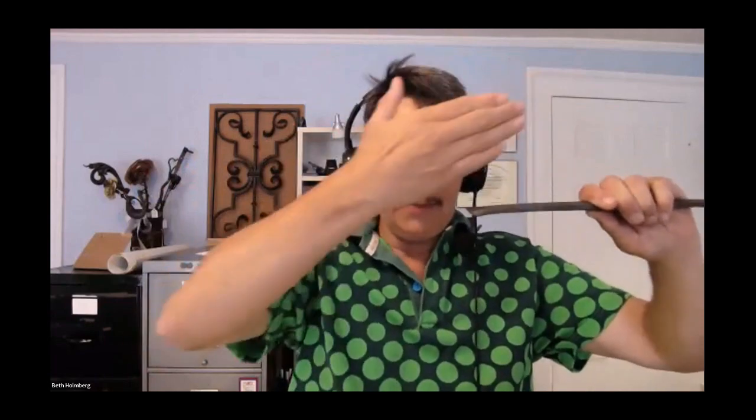So there's a fish tail. Making the fish tails to start with, the biggest thing is that you're using the peen on your hammer, right? You're still making a taper. This is the first important thing. When you're using the peen, it's still hitting at an angle so that you make a taper, and you still start steeper and then slowly make it longer and get further back. The biggest thing is that your peen needs to stay parallel to the length of the metal the whole time.